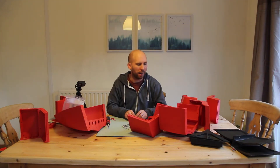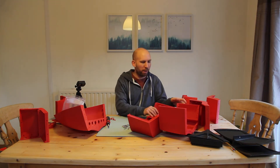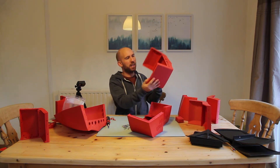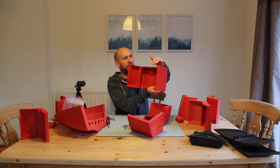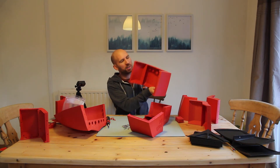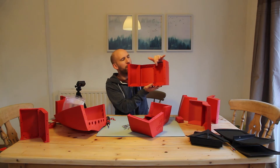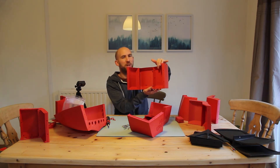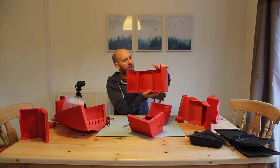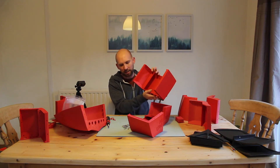When we create the boat in Fusion 360 you have to design it with 3D printing in mind. Initially I wanted to build the whole thing as one 3D print, but you have to think about how it's going to be built. Take this piece for example — if you print it like that, this piece has nothing to support itself, so unless you print supports this piece is going to collapse. The print has to go on the bed that way so it can print up. You can print off to maybe 45 to 55 degrees of overhang, but as soon as you get past that with a straight overhang you have to print supports. You really do have to think about how it's going to 3D print and what things you may have to print off in different parts and bolt together.